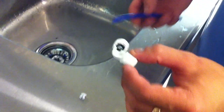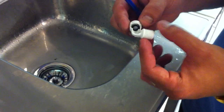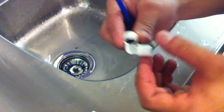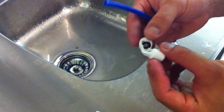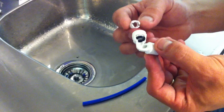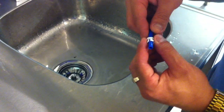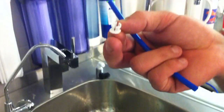There are many companies that make the quick-connect or easy-fit fitting. This is a cutaway of one of the elbows — quarter-inch thread to quarter-inch tube. This is the locking collet that is pushed into there; that is what keeps the tube in place. The teeth on that — there are little metal teeth — that's what grabs the tube.